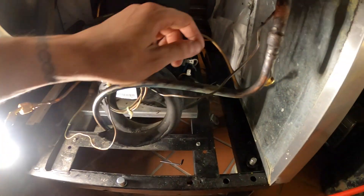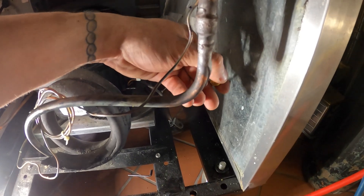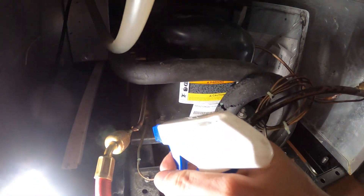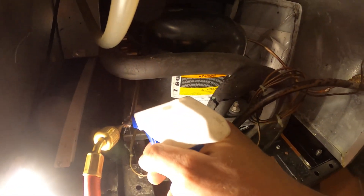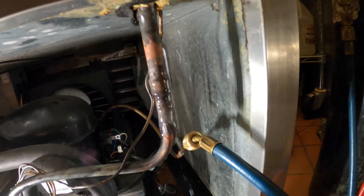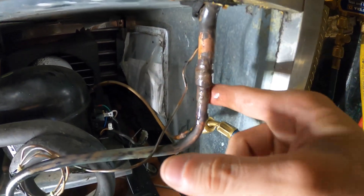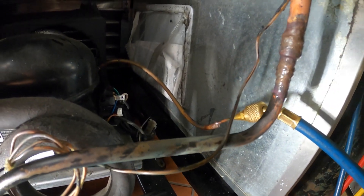Inspecting the braze, connecting my hose, running nitrogen through the system, and clearing the line in case anything got caught in there. We've got about 250 pounds of pressure and it is equalized. Let's go ahead and spray these connections — make sure the braze held with the pigtails and, most importantly, right here — make sure nothing is leaking.